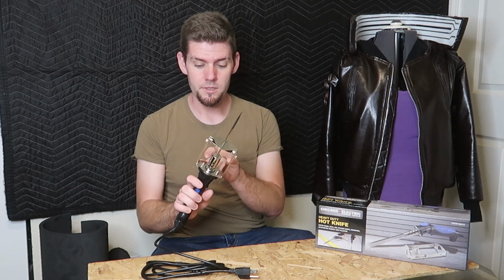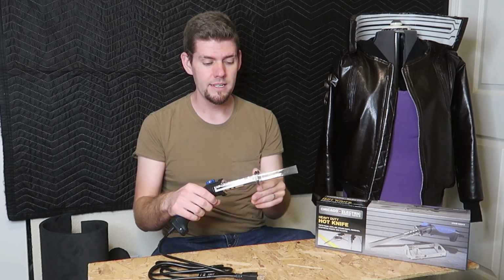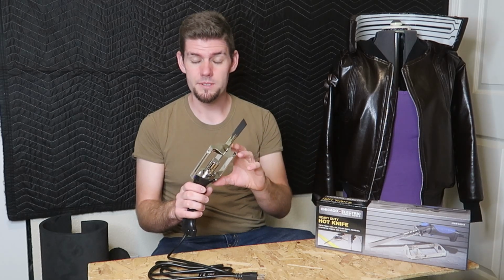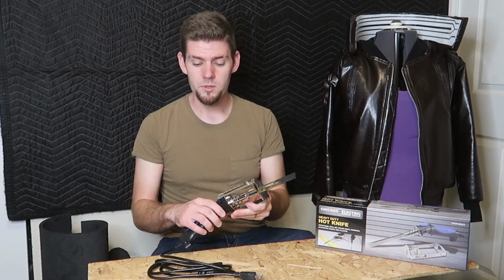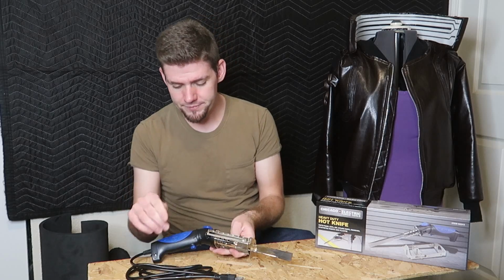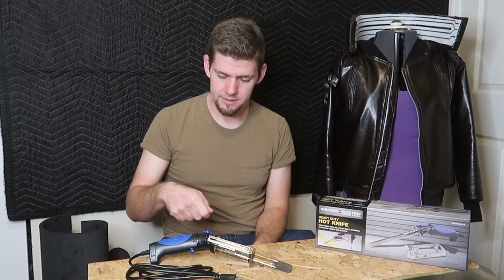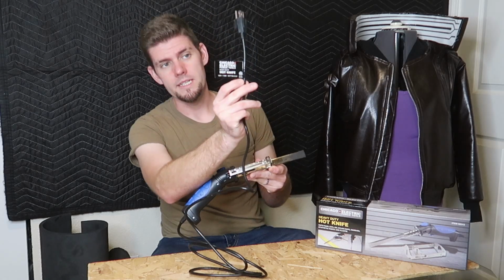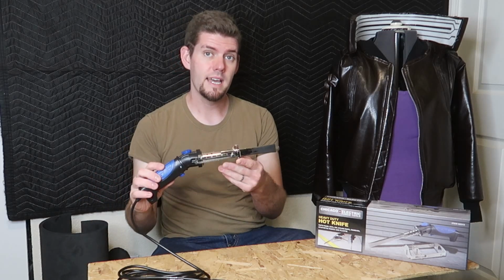If you were to, you could also remove these two little nuts right here, and this whole cage comes off. So if you have no need for that, and you're just making straight cuts, quick cuts, and you're on a job site, you can remove this cage, which is nice. If you were consistently wanting to cut a certain depth into foam boards, insulation board, then you're more than capable to take that off, make all your cuts. And oh yes, the technical maximum is on the actual little tag right here. It's 840 degrees Fahrenheit is what it says that this is rated at its top maximum.